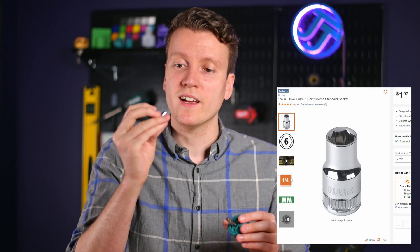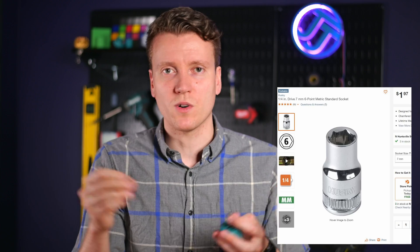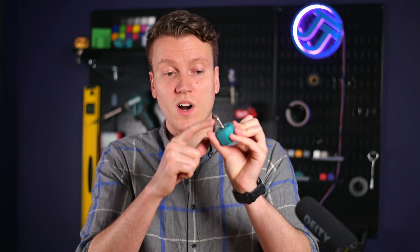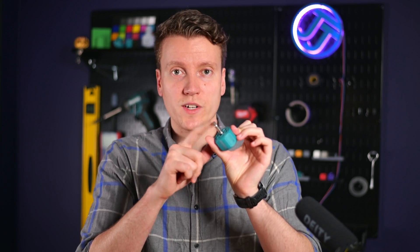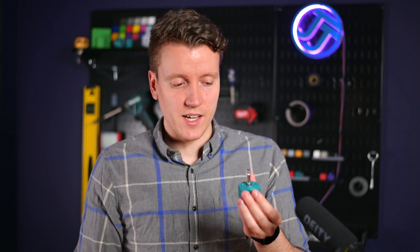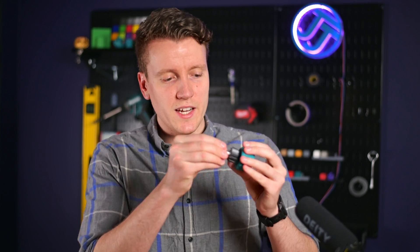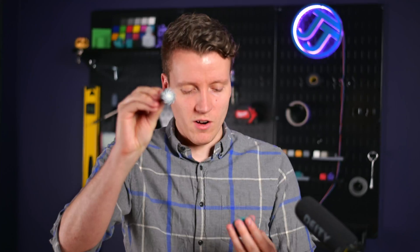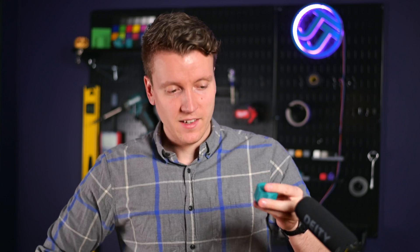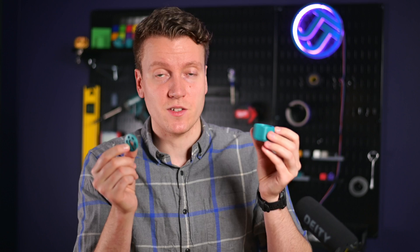On top there's the ratchet part — this is a 7mm ratchet. I picked it up from the local hardware store; it was under $2.00. The next rod is a hex to quarter inch adapter, quarter inch because this socket I was using is a quarter inch socket. This top cap unscrews off so you can get into where your little blades are, and then your case. This case piece I printed in PETG — that's just because I wanted these colors to match the rest of my printer.